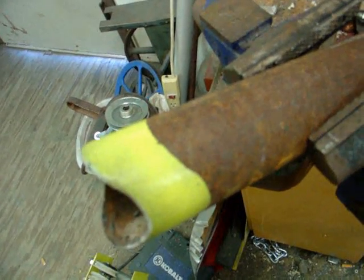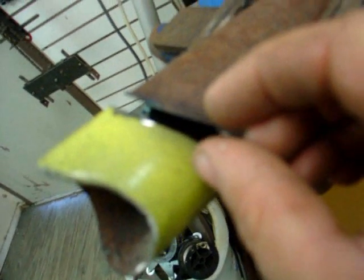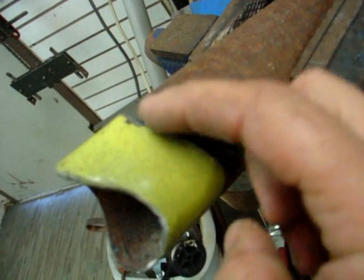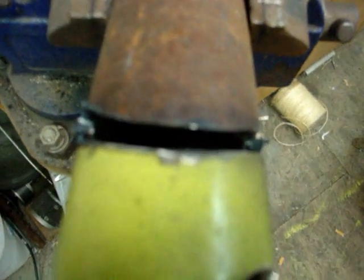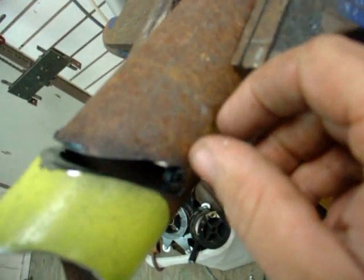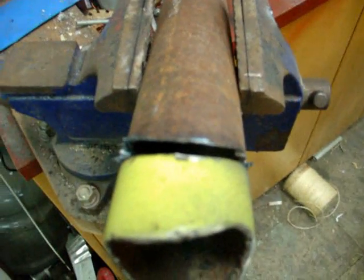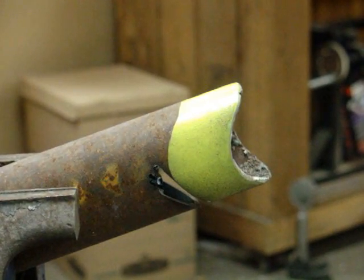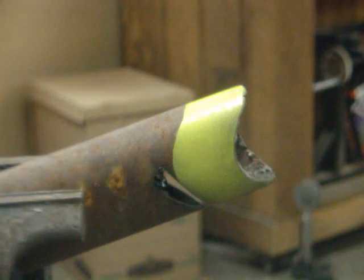To show what I've done so far: there are a couple of cut lines. I started the first cut back here leaving a slight space away from the line, then came back and rested on the top, slowly coming down — making it wider so the blade won't grab and try to take the saw out of your hand. Then I can look down and see a straight line, getting more of that curve. I've got a small piece left to knock off. I'll flip this over and do the other side. I've got a blast shield to cover my eyes, but a two-liter bottle will work for the camera — sorry it'll distort the image a bit and probably mess up the audio. Back to work.